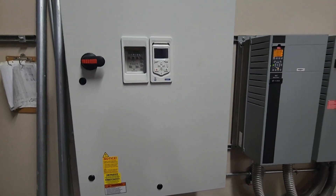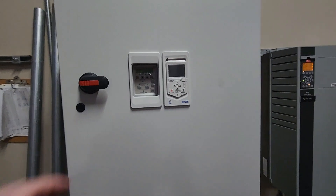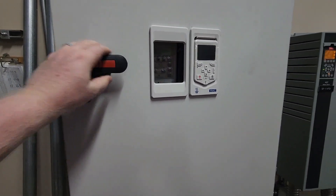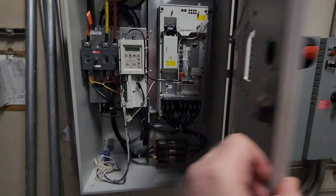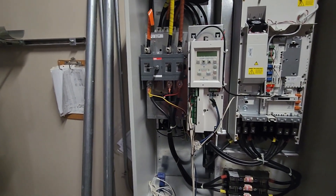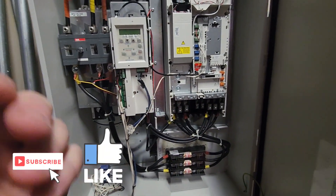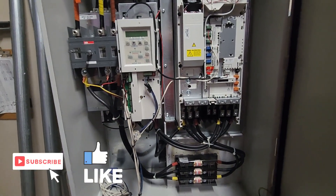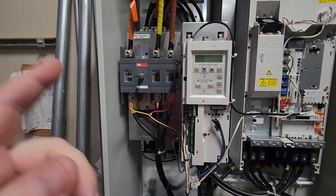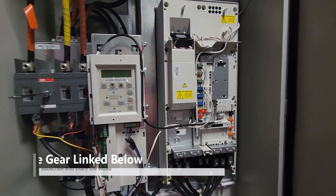It did require some reconfiguration as far as the electrical, but the guys got it taken care of and we are now ready to get this going. The first thing that you're going to need is your motor information, which I've already got off of this. I don't have the power turned on yet — it's still shut off over on the breaker. I'm going to go through the process of checking everything. You want to verify your wiring and your voltages, and then we're going to go in and actually set the drive up to do what it's supposed to do.